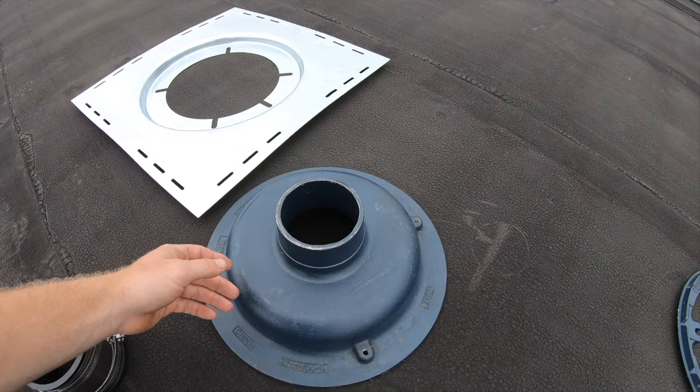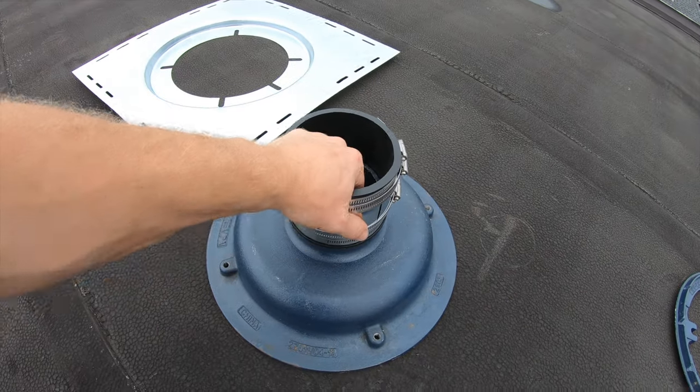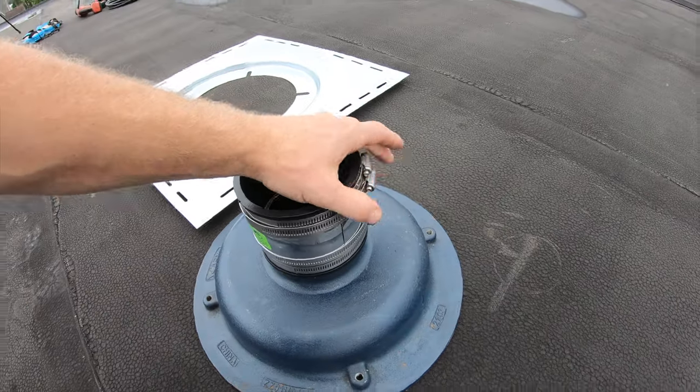And one other thing is, whenever you secure a cast iron drain, obviously you can't glue PVC to cast iron, it doesn't work. So you have to use a coupling. So we use this metal band Fernco, and that's burial rated. And this is the upgraded version.